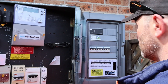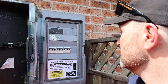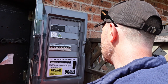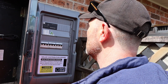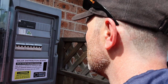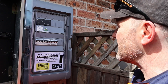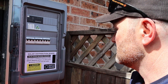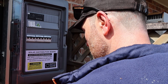The other test I want to do here is for anti-islanding. I can do that in two stages. First I want to knock out the main switch inverter supply and then make sure the envoy turns off and the relay turns off — that has to happen within two seconds of the power being cut. Once I can confirm that, I'll re-energize, and it can't re-energize within 60 seconds. Those are the two tests I check.